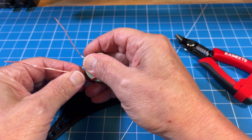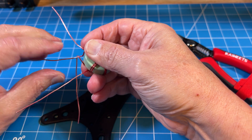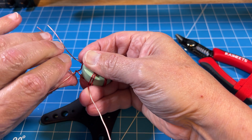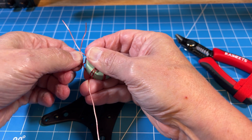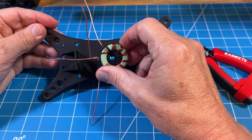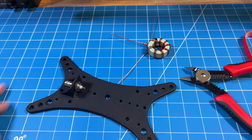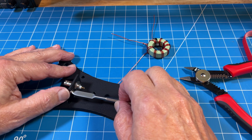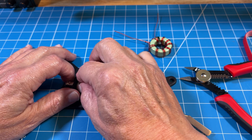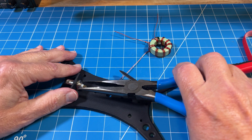It's time to take those two center wires and wrap them as tightly as you can one around the other — maybe three turns. Just think about the fact that you're going to be soldering these two together to complete that contact; that's why I say wind it as tight as you can. You should refer to the instructions provided with the antenna kit as well as follow along with this video. Then put this up next to the winder and visualize how things are going to fit in the final product. I did read the suggestions prior to starting — you might know them as instructions — and I wanted to see how that wrapped toroid fit on the winder and where it would fit with all the other connectors. That's why I waited until last to put the connectors on.